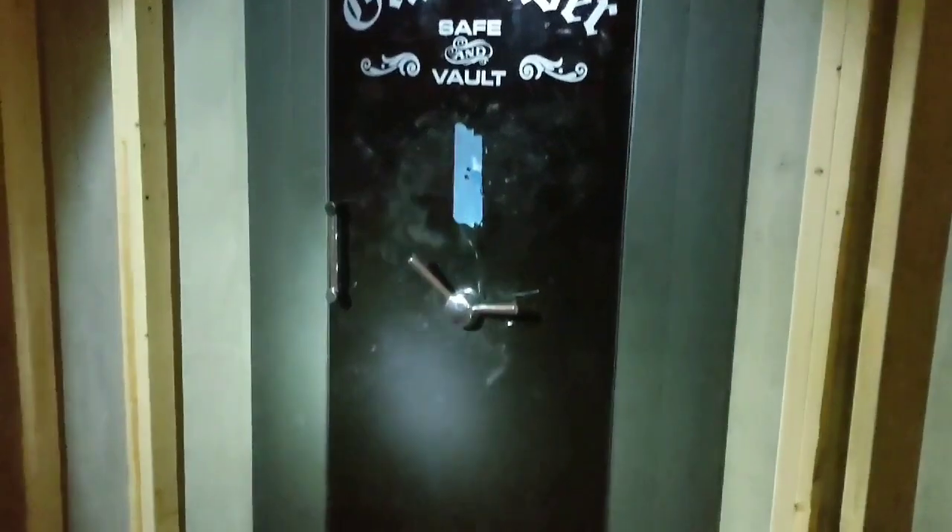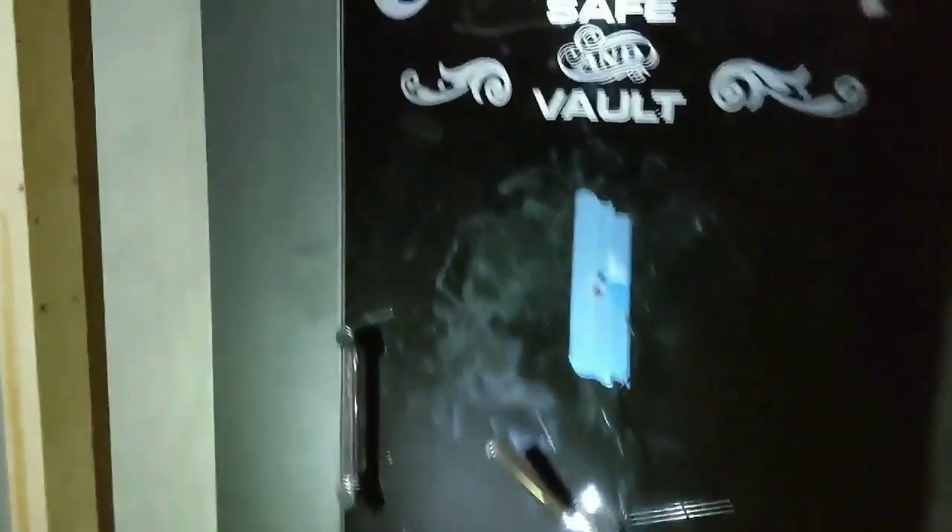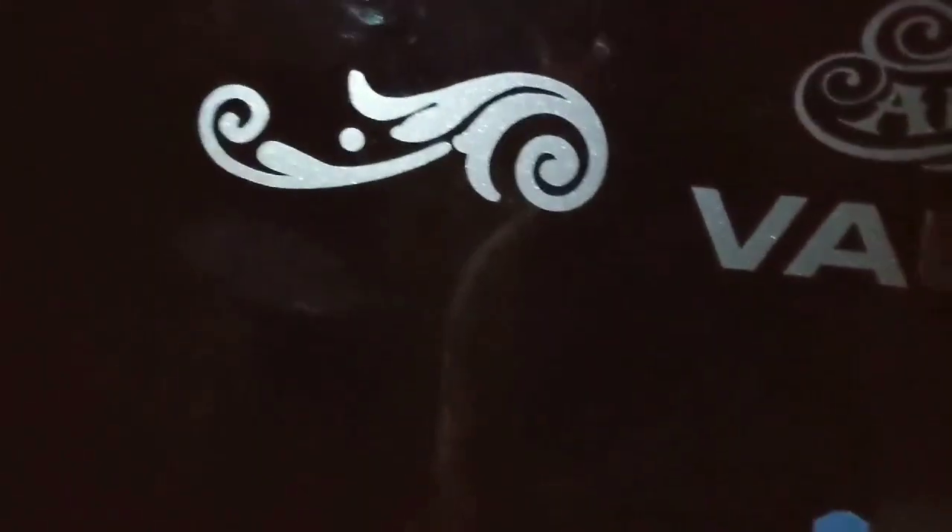So you'll hear what his take is on a Graffunder here in a second. It was moisture buildup where the vault was built — concreted in-room, sealed door, and no air vent. The no air vent installed meant no way for it to breathe. So over a long amount of time, moisture from the night-and-day temperature cycle built up really quickly with no air circulation inside.